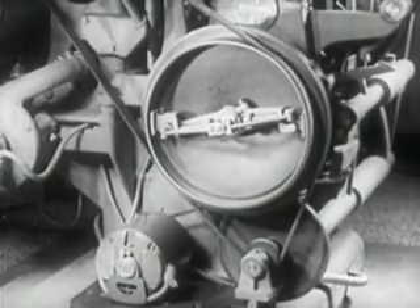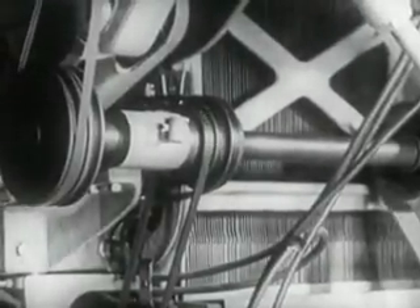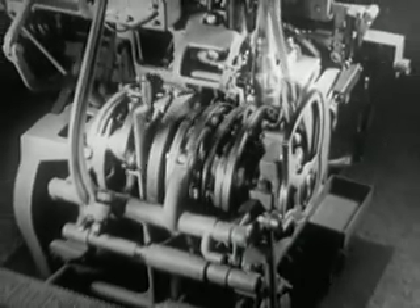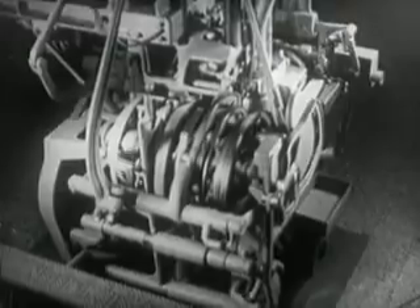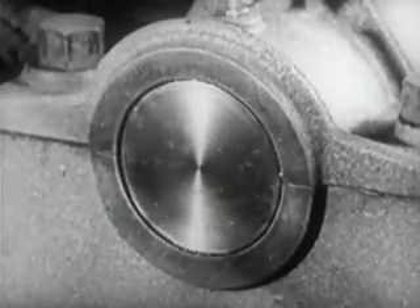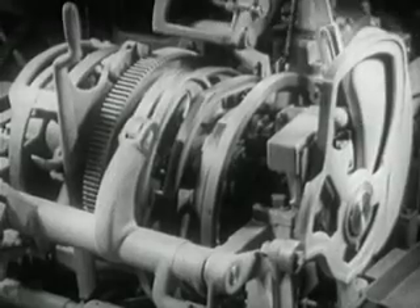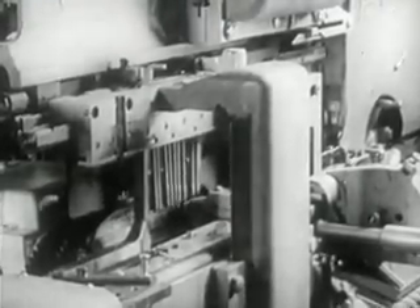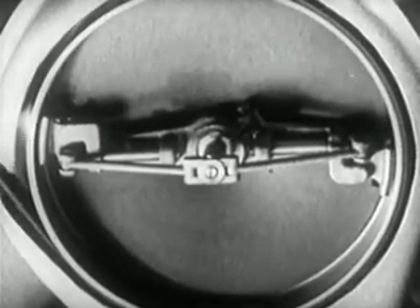Let's go into the explanation of this group. A one-half horsepower motor supplies the drive transmitted by a large pulley through a transmission gear and belt. Many of the basic mechanical actions of the machine depend on the 10 large eccentric cams situated at the rear. With a series of springs, they make up a completely automatic setup. The two friction shoes of the driving clutch are then pressed against the inside of the driving pulley, thus causing the driving shaft to rotate the cams.